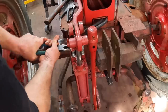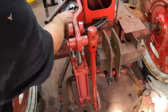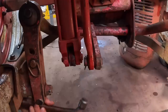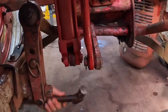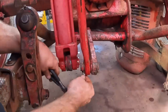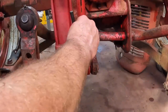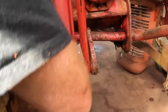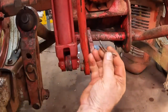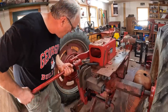We just got to take out this huge cotter pin in this bushing and this bottom cotter pin. Maybe we'll punch you down from the top and pull you out from the bottom. There we go. Now we can pull this off and drop things. Then you can come off.